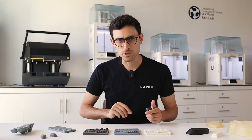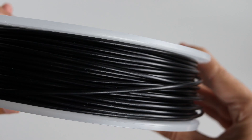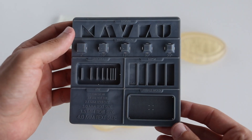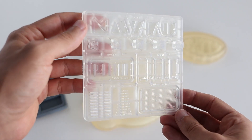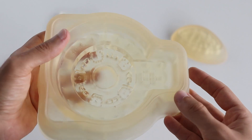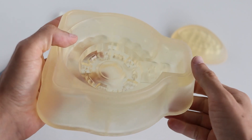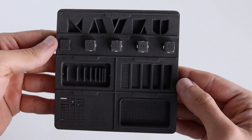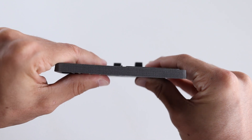What about the materials used to 3D print these templates? For FDM 3D printing, we recommend using materials such as nylon or composites that include carbon fiber. When it comes to resins, most standard ones like clear or gray work for early prototypes, but we recommend high temperature or rigid resins for final templates. For SLS, we recommend using the default material, which is PA12 or nylon 12, as it has very good properties that make it ideal for thermoforming applications.